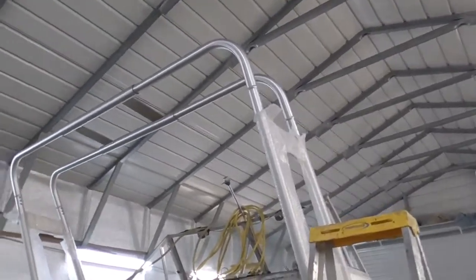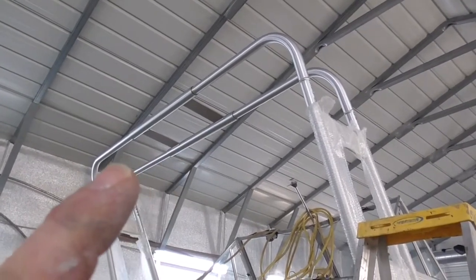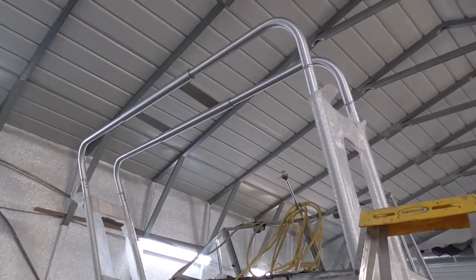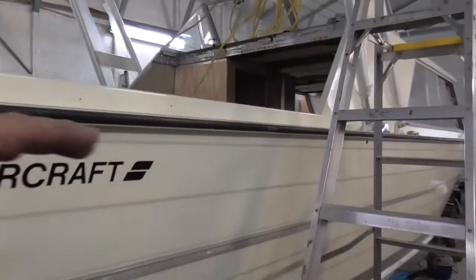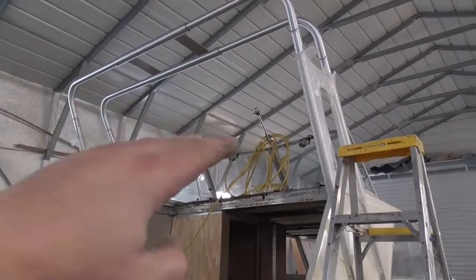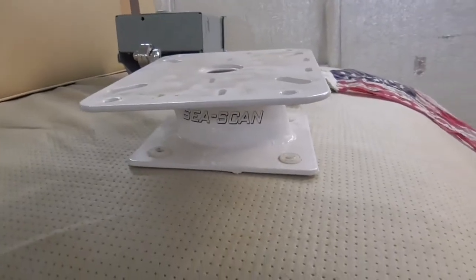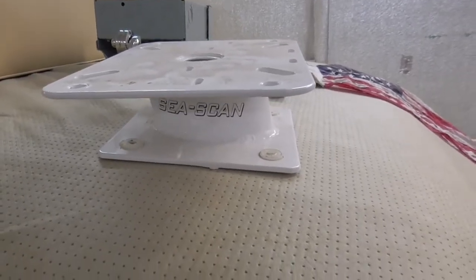Now all the bolts are tightened up all the way down from the gunnel, holding this bracketry together. The last thing in the middle is to put the four bolts in that hold the slidable radar mount piece — we have to drill the holes and get the nuts and bolts in on that. You can't see it on camera here, but this forward bar sits about a half inch to five-eighths of an inch lower than the rear bar — there's a slight tilt going towards the bow. The reason I want it that way is when we mount our radar array, the boat does not sit level in the water; the boat sits slightly back. That's going to focus our radome so we get a farther transmission down the lake and it doesn't hit the water and bounce off.